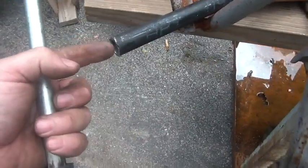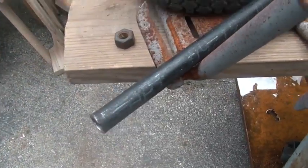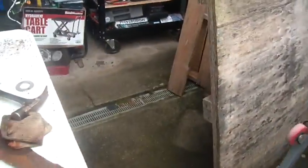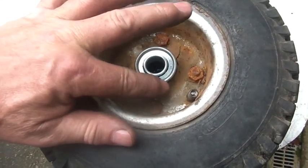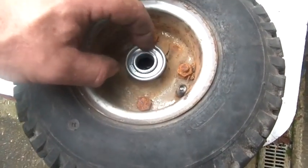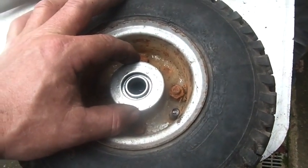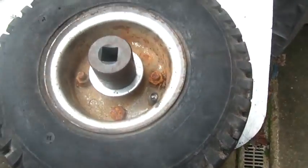So what I'm going to do is cut the length I need for spacers, and then if I have to run a bore through them just to clean them up, I'll do that on the lathe — I'll show you that in a moment. You can see that's an old bearing; it seemed to be in decent shape. There's a new bearing. Installing bearings — just quickly — probably 90% of you guys know how to do this, but just to refresh: the trick is when you're putting a bearing in, you want to push on the outside edge. You do not want to push on the bearing center. So what I did is I put this on there, then I put that right there such that I'm not touching the center anywhere, and you tap them right in.